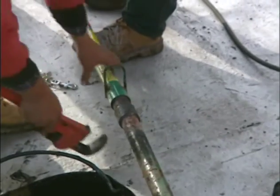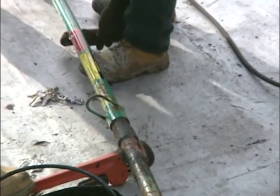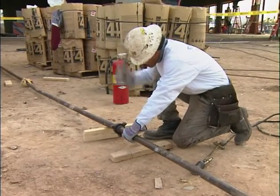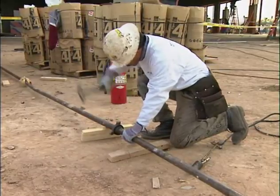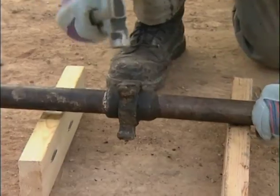When tightening the coupler, use 2 pipe wrenches in opposite scissor-like directions to secure a tight fit. You may also run across these knockoff type couplers. This process is repeated until enough pipe sections are assembled to complete the desired length.